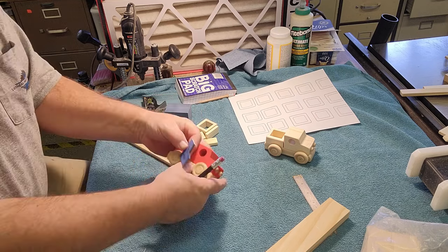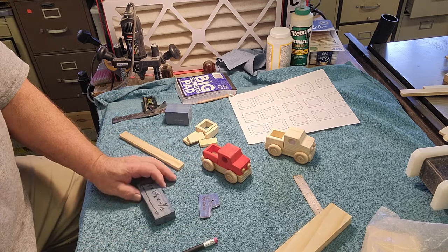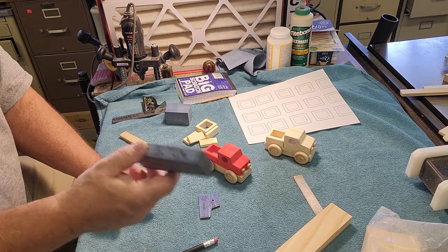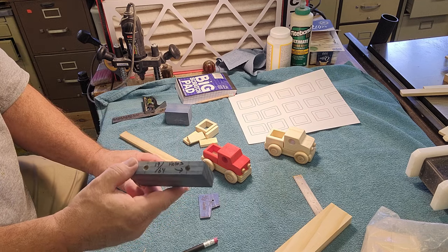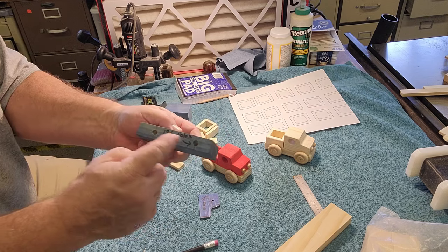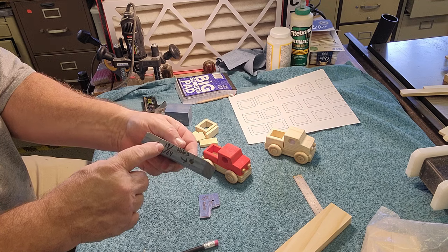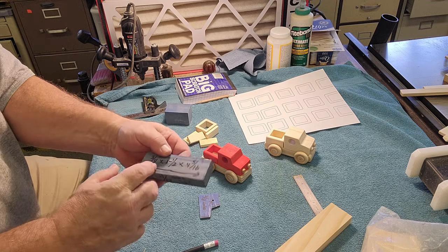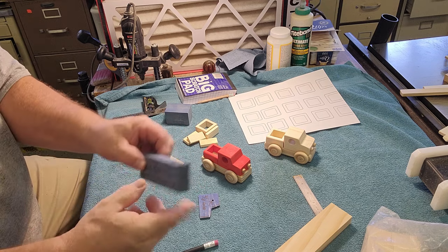I made a template. Now, if you watch a lot of my YouTube videos or follow me on Facebook, you'll see that I make a lot of templates so I don't have to try to think of what measurements it was or write things down. Say like this right here is for the base. I already got my holes drilled in here for the wheels. I got written down on here a 19/64 hole for the wheels. I got the thickness, width, and length of this base written right on here.